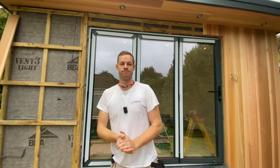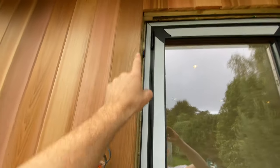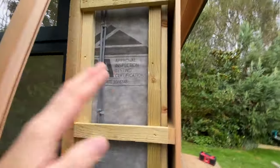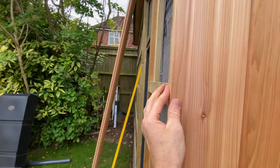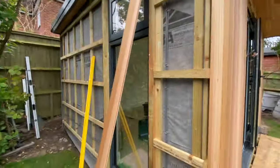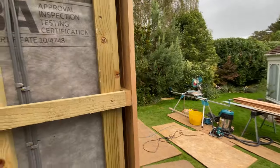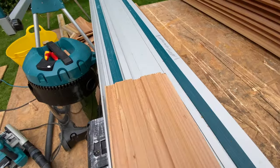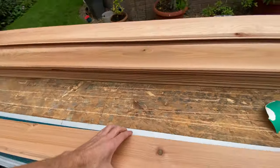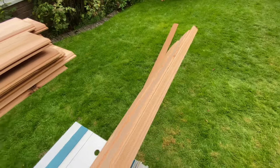We've worked all the cedar up, done our cutouts around the door aperture — this one actually worked out really well, just a straight piece. Now we've got our final piece at the end of the building. We offered a piece of cedar up, marked it with a pencil, and ripped it down on the track saw. The offcut piece left us with a nice little piece for our corner. I've gone over the cut edge with 120 grit sandpaper to remove any discrepancies — it's nice and smooth.